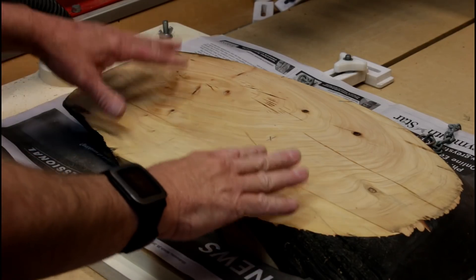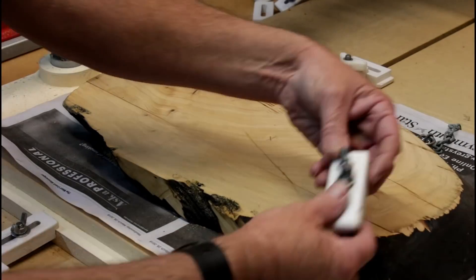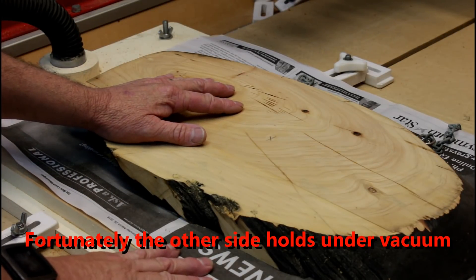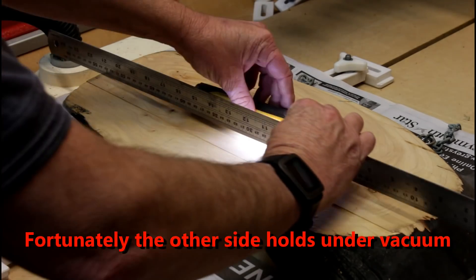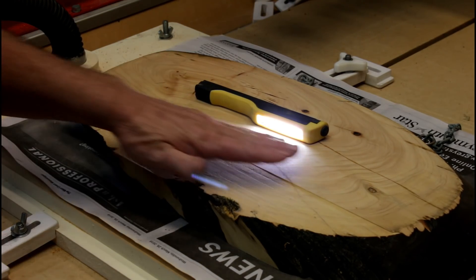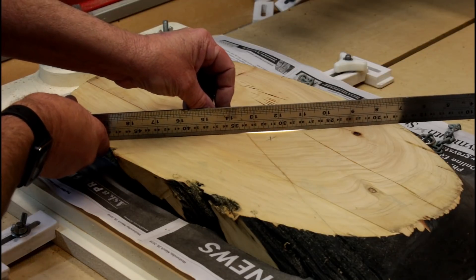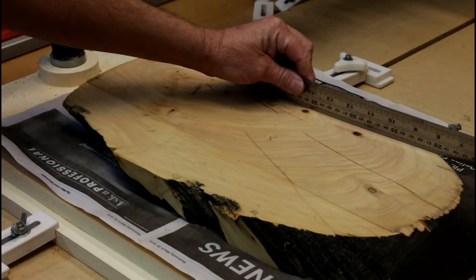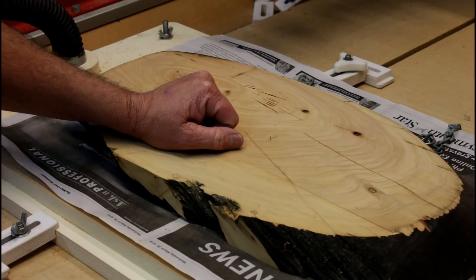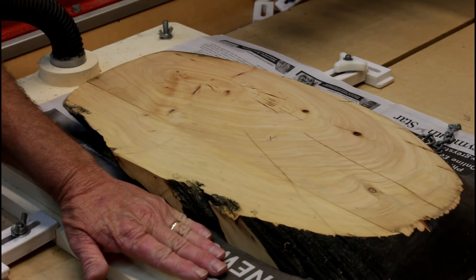This is exactly the sort of job I made my hold-down table for — a piece of material that is oddly shaped where standard clamps just won't work. I want to V-carve the other side of it, but unfortunately I can't hold it down even with the vacuum table, because this is the back. You can see there's a slight dish in this piece of wood, and there's a snipe on this end where it's gone through a thicknesser. It's dished all over the place, so the first thing I want to do is flatten it. By running a ruler over it, I found that this is the lowest spot, so I brought my cutter over, set it down onto this spot, and set that to zero. I'm now going to machine this surface flat, which will give me a holding surface I can use on the vacuum table to machine the other side.